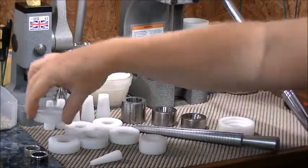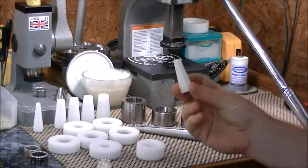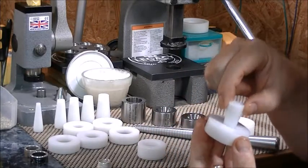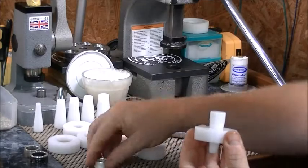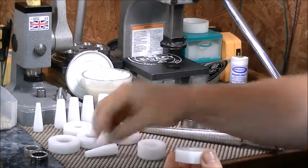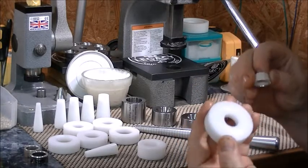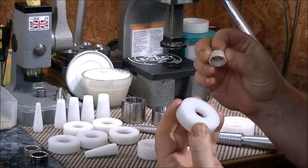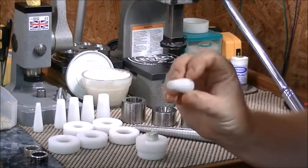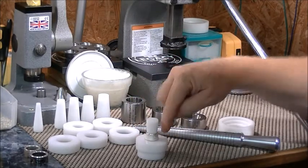Let's go to the next size cone. I'm going to change to the next size cone, but I'm going to use it in the same lid. Knowing that it does not go through this, I can only go down this far. The reason for that is I like this reed to sit well on my lid. If the reed is too small for this hole, make sure you use the next size smaller lid to support your ring before you press the cone down into it. So I'm going to use the next larger size cone and I'm going to confirm I have space before this cone hits this lid on the inside.